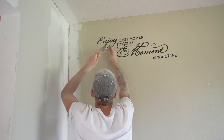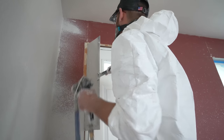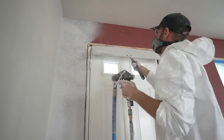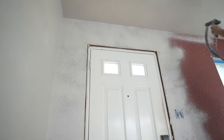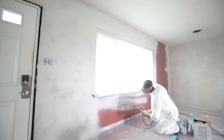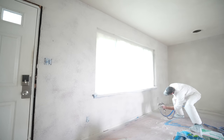There used to be a mural on this wall — we're covering it up. It's one that had some of the worst drywall seams. With this wall being the first one you see when you walk in the house, I spent a little extra time blending out all of those seams and doing a decent skim coat — that way when you walked in, you got a good first impression. And now it's time for our final wall! I cleared my things off the window ledge, and above this doorway I've got pretty bad seams or cracks in the drywall. This is common on pretty much every door and window in this house and that's why I sanded all the walls down and I'm doing a new texture on top. I'm doing the lightest orange peel texture possible for a modern contemporary look.